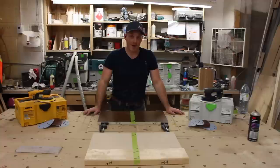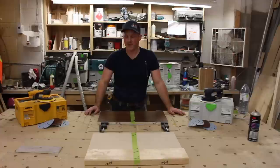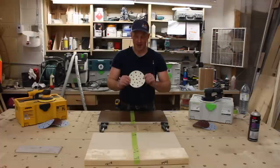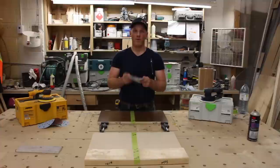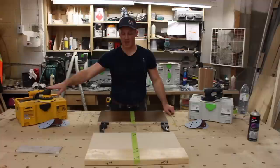The reason I'm using maple is because it'll be easy to see scratch marks when I put on the pigmented stain. The reason I'm using a pigmented stain is because the pigment will sit into the scratch marks and show them up a lot better. I will be using Festool sandpaper — 80 grit Granat, 100 grit Rubin, and 150 grit Granat — on both sanders. So we won't be using the Mirka Abranet on the Mirka sander.